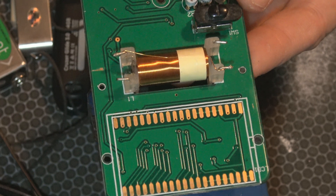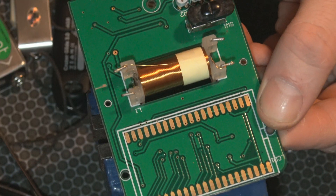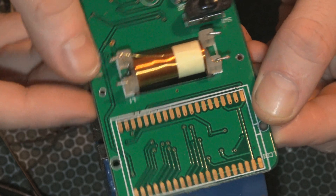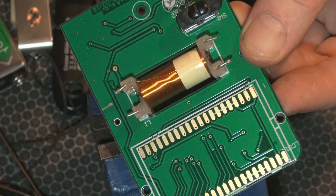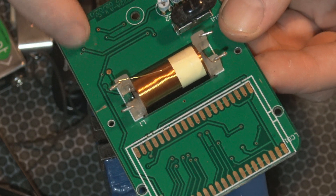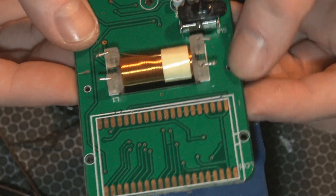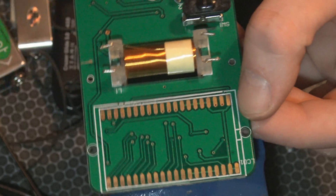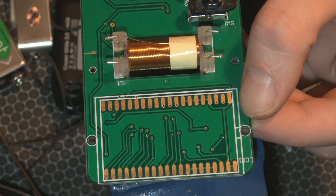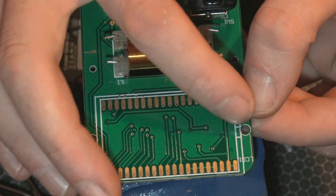Now to power them — I'm gonna scratch the insulation off the ground plane, which almost everything on this top side of the circuit board seems to be. Just follow it from where the black wire connects. See these little small traces in the middle here — you don't want them. But this big huge trace up here, I'll make sure it's somewhere it won't interfere with the case closing.